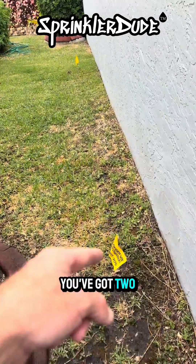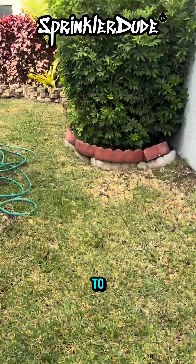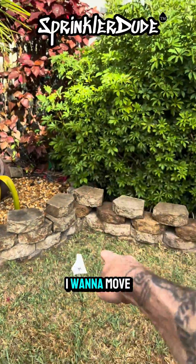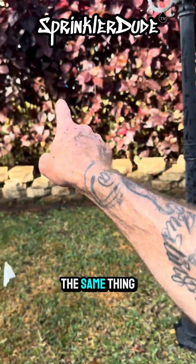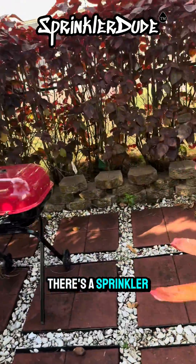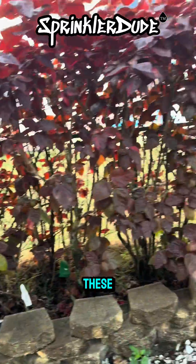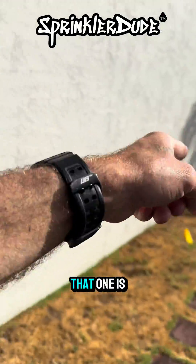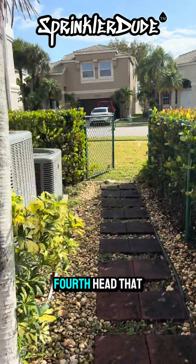On the side of the house, you've got two sprinkler heads that don't pop up when they get turned on, so they're not going to water the areas they're supposed to — we need to replace those. In the backyard, there's a sprinkler head back there I want to move out to the front so it can water towards the bushes and cover all of this turf. I want to do the same thing with another head — move it out to where you see the white flag. There's a sprinkler in the back I want to move closer to the front on a riser so it waters the front of these. These heads do not pop up, that one is broken — so all three of these need to be redone.